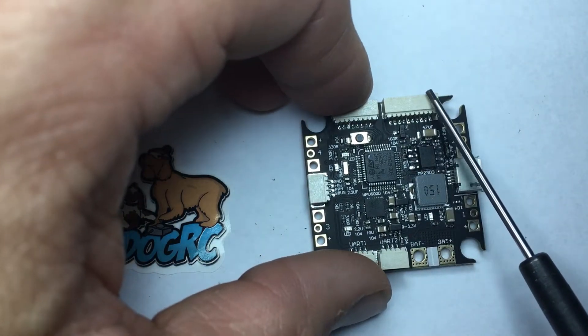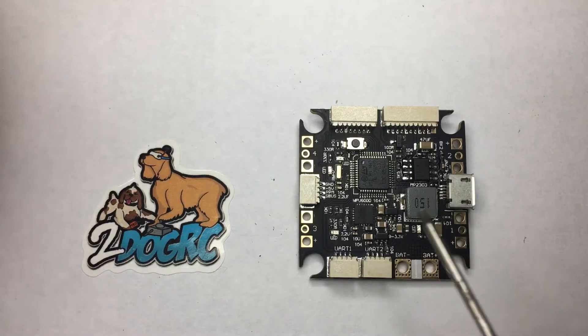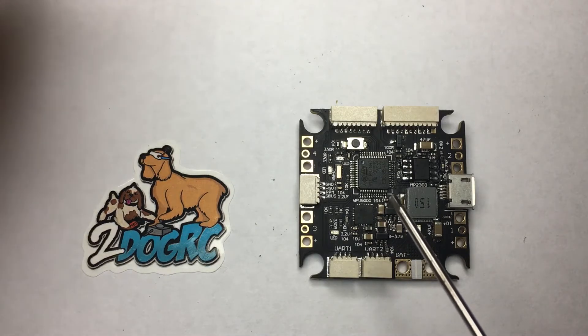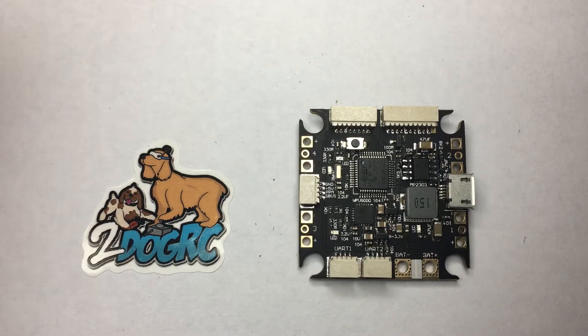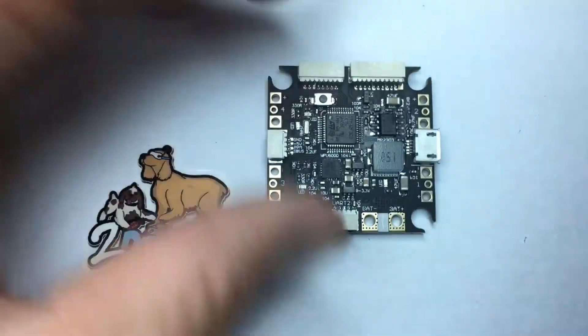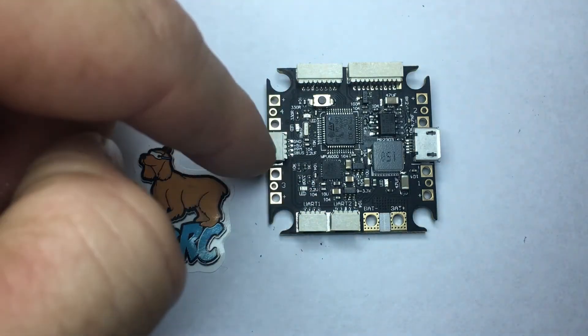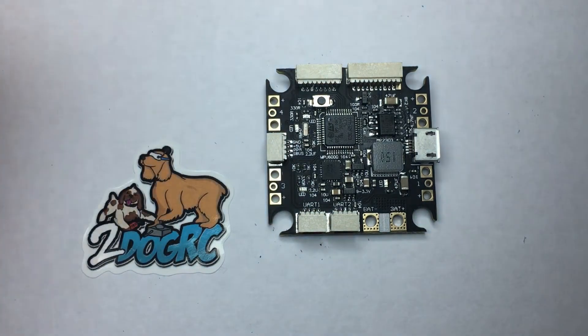This big connector here is where you're going to have your buzzer, your video, and your camera get plugged in. Now this uses the Betaflight firmware — Betaflight Fury F3 OSD is what you need to flash on this one. That's a general overview. I'll put some specs up in the description. So: MPU 6000, 16 megabytes of flash, maximum continuous current 140 amps, the BEC is rated for 1.5 amps off your 5 volt for your receiver and anything else, and your outputs max at 35 amps on each speed controller — four times 35 is 140. And it's a standard mounting.